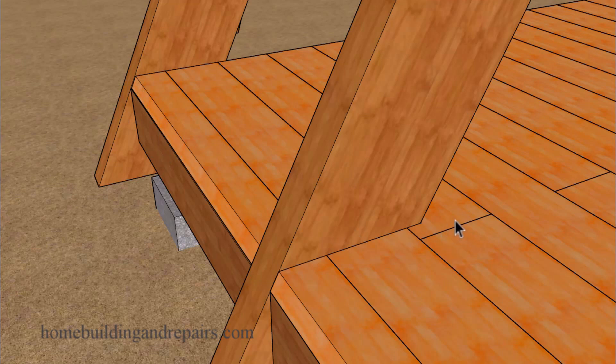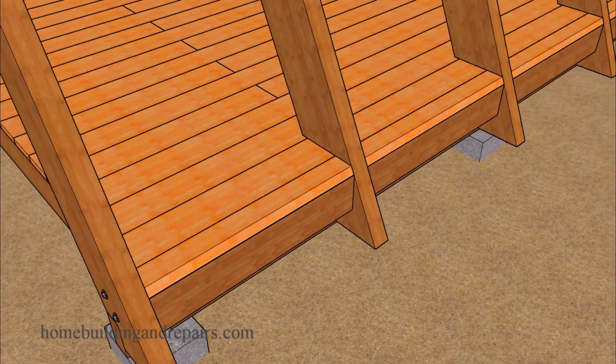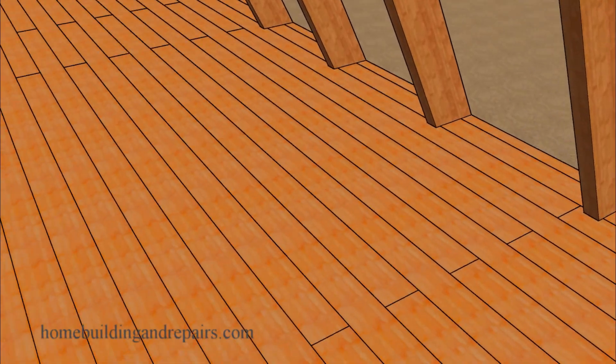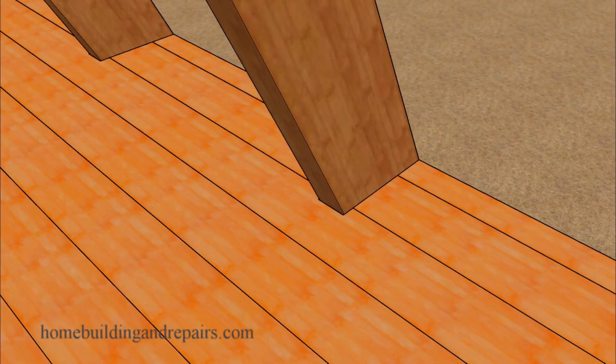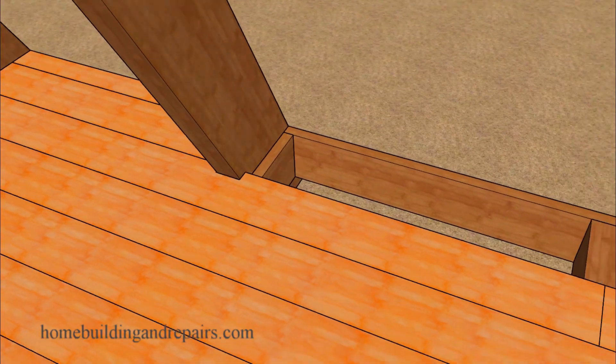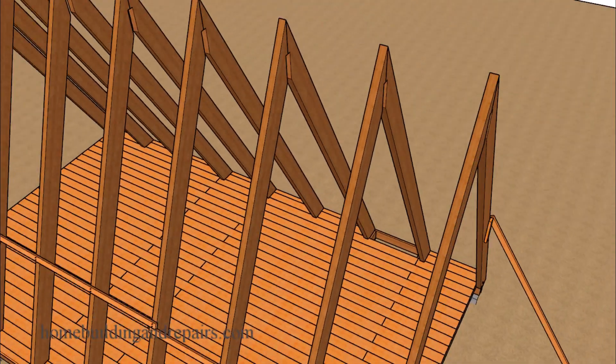In this example, we're going to be notching a section of the floor sheathing to go around the rafter beams, and then cutting smaller pieces to fit in between each rafter. You're probably going to need to nail the floor with 16D nails, and make sure that the floor sheathing has at least a 4-foot break between the joints. You could always do two boards at a time — I chose not to do that here, but I will provide an example of that with the roof sheathing. Leave at least a 1/16-inch gap between the rafter beam and the floor sheathing.